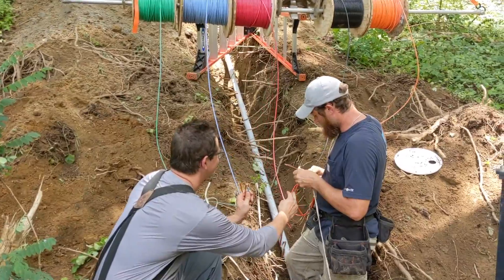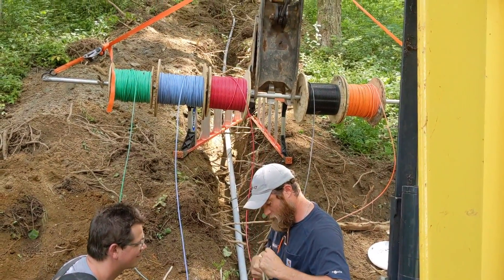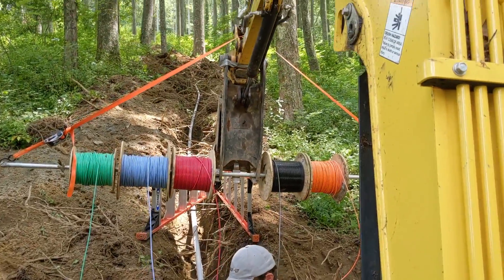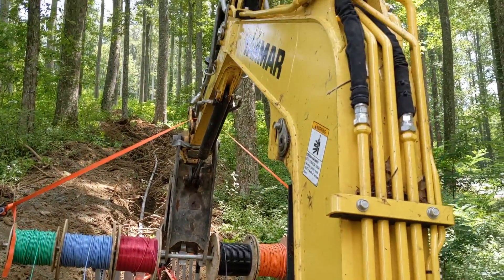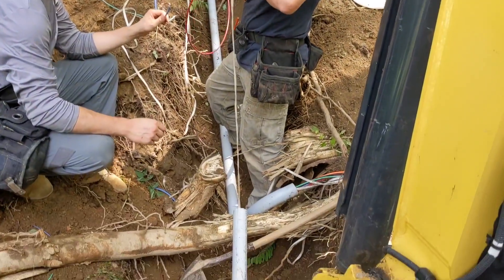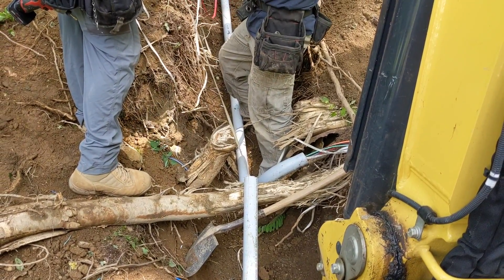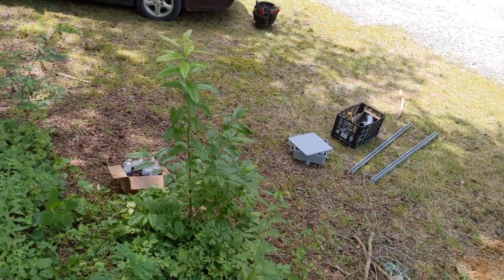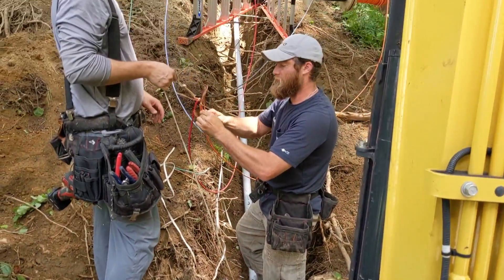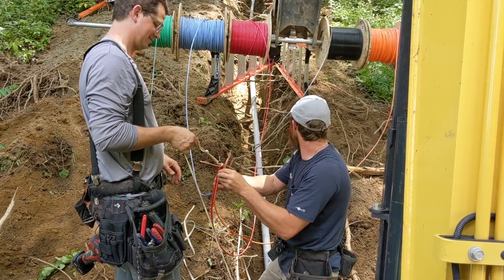We're set up to do the second stage of our pull — it's really safe. The guys are always worried about safety, which is good because I'm sitting in the excavator keeping them safe. We're pulling in the next 400 feet and we're gonna put a pull box junction here that we'll bring up out of the ground into that box, and we'll put some strut on each side. We're gonna try to pull it in with the little gizmo even if it breaks something.